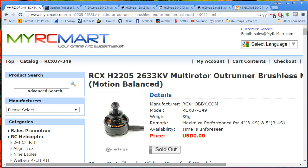A 2205 or 2204 2300 KV motor can spin basically any 5-inch prop that you want. But on many of these 5-inch props, it's actually going to be under-propped and not making the most of itself. So in order to get the most out of a 2300 KV motor, you start going to 3-blade props, 3-blade bullnose, and then you get efficiency losses because bullnose aren't very efficient. You also get the fragility and expense of tri-blades.